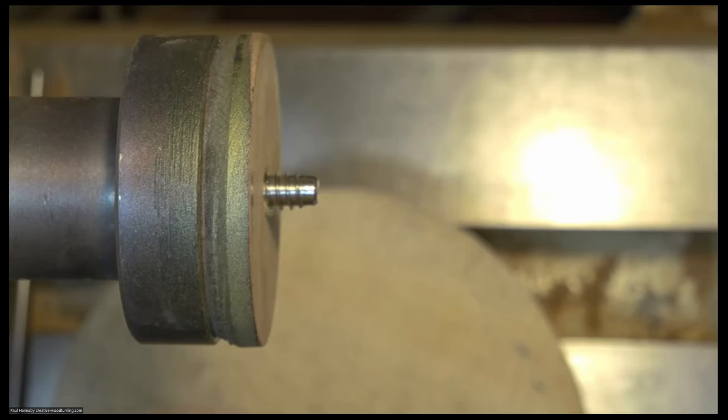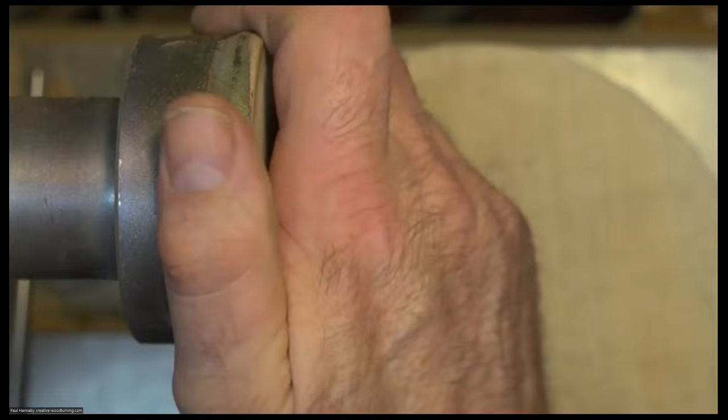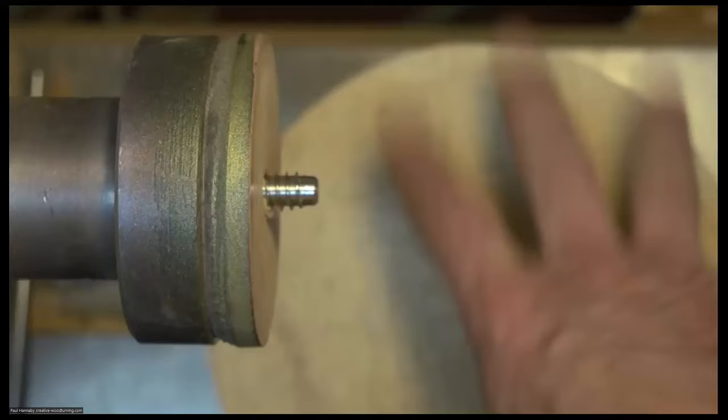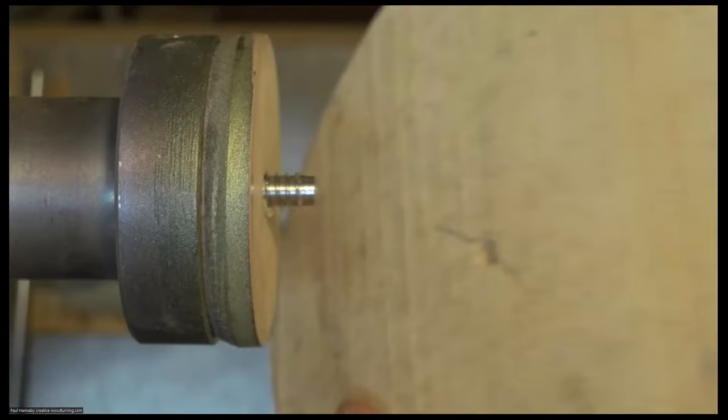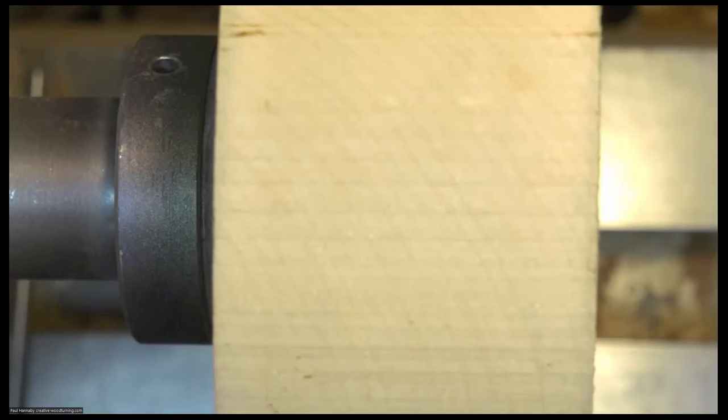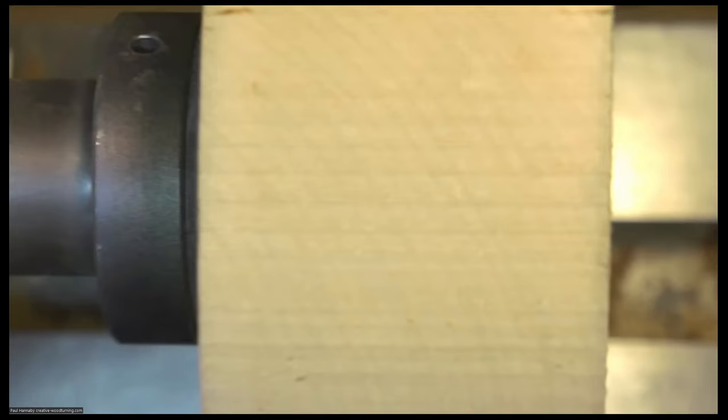It puts your piece of wood closer to the bearings, and it's always a good idea to keep your wood as close in as possible to minimize overhang. There's a wooden spacer — probably three-eighths inch or so — and any type of wood is fine for that. On a smallish blank, a short screw is fine. I've actually got the thickness to put a hole in for the full length, but roughly half the length of the screw is enough to hold it. I drill it eight millimeters — five-sixteenths — for this particular Axminster one.